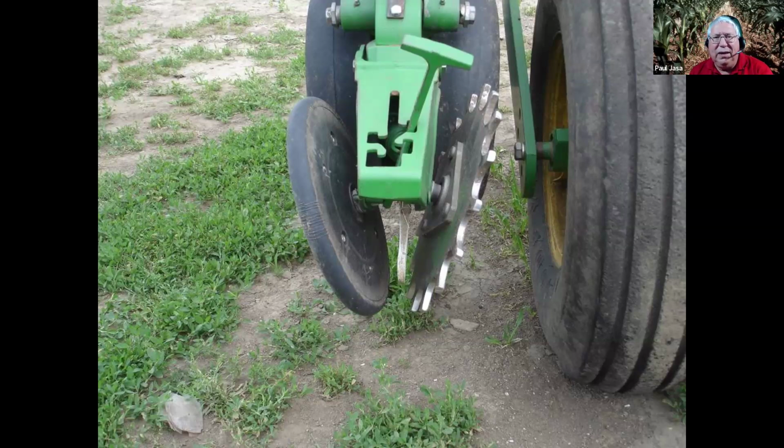Now, unfortunately, if you know the Martin wheel, notice there's about 1.5 inches missing off of every one of those spokes. In your mind, draw those spokes 1.5 inches longer on the bottom there, and you'll see it's going to pick every seed out of the seed V. This producer took his cutting torch out and cut 1.5 inches off of every one of those spokes across his 16-row planter. It took him a while to do it, but it made it less aggressive, and he loves it.